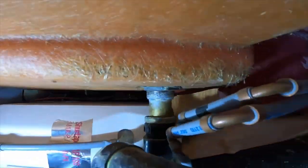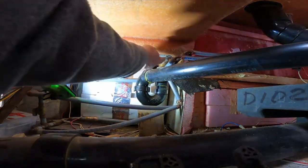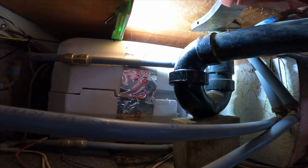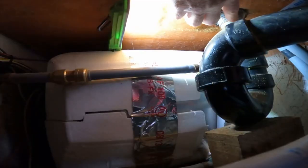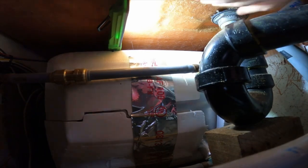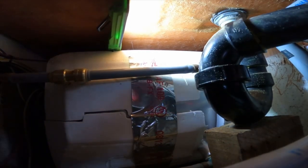You can see the drain assembly right there underneath — it's got some thread showing. I already removed the bottom collar off of the trap. The trap is that S- or C-shaped elbow that fills up with water and creates a water trap, so gases cannot pass back through the drain and make the coach smell. I'm gonna move this back so you'll be able to see.